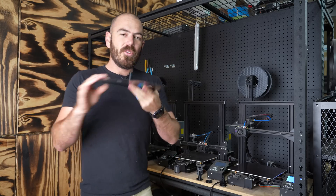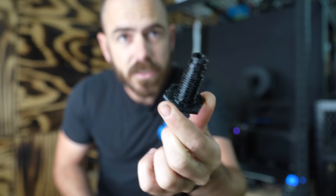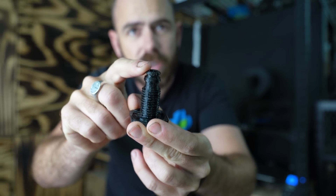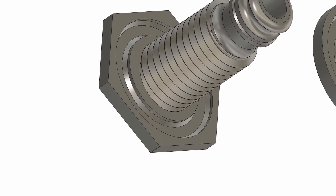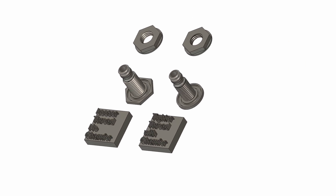A 3D print that I will be releasing today is this. I'm quite proud of this. This is one of those designs that you didn't know that you needed until you've got it, and once you've got it, you just don't know how you ever lived without it. This is just a bulkhead fitting that allows you to fit a quick connect fitting over the top and seal with silicone around the base in a small channel. This will allow us to utilise any container for a reservoir in a manner that is simple, requiring a single hole be drilled and easy to connect and disconnect. Let's put it into practice.